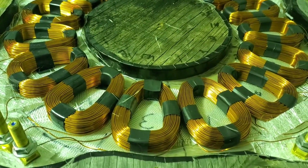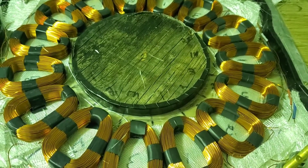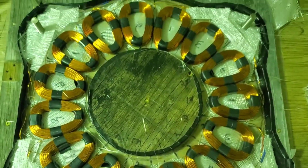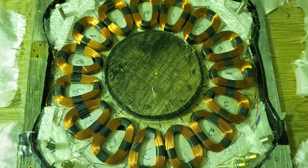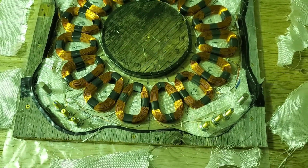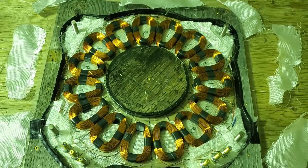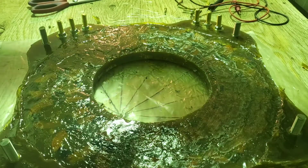Like I said, I'm going to have a star/delta switch for this. If I need to step down the voltage, I've got a three-phase transformer that'll go from 600 volts down to 200 or 120 — I can do that with the transformer, and it's good for 60 amps. It's easy to make a switch for the wind to turn the turbine on and off when the wind isn't blowing so that it's not loaded to start. It's going to have an 80-inch diameter when it's all done. Well, there it is — 10.5 pounds of copper coils, 15 coils, high voltage stator.